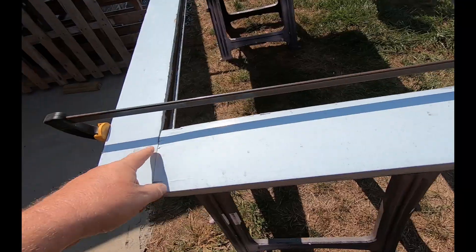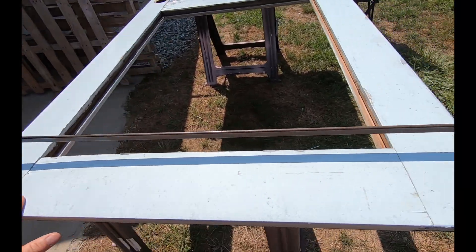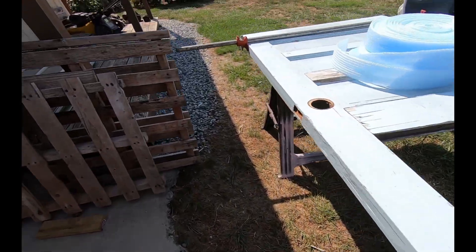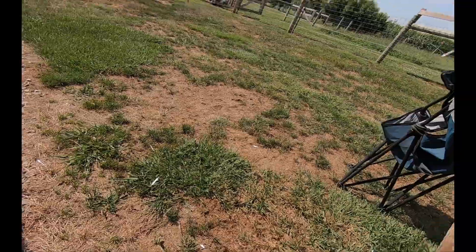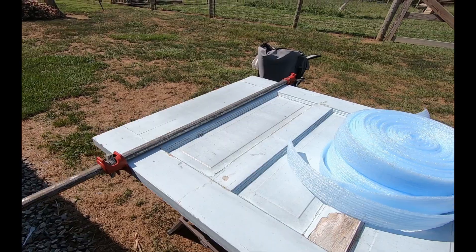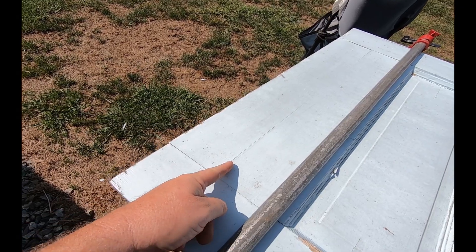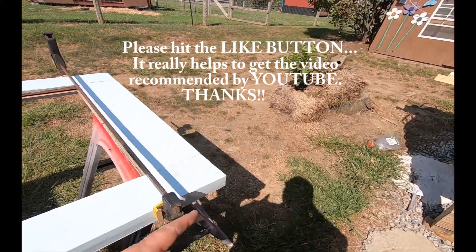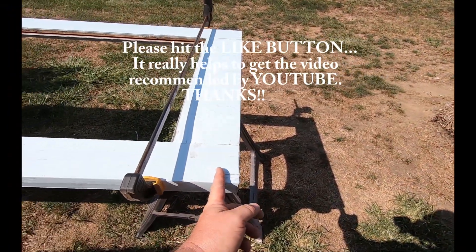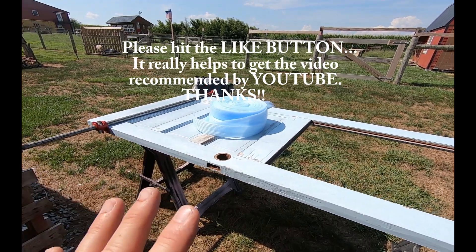It was a one-pane glass door with a big pane. I pried open the joints, glued them, and clamped it, so this door is all nice and tight again. But there is some rot down here on the bottom. I'm going to take off the bottom panel right here — cut that off — and cut off an inch or so on the top. I want the door shorter so proportionally it fits in the house better.